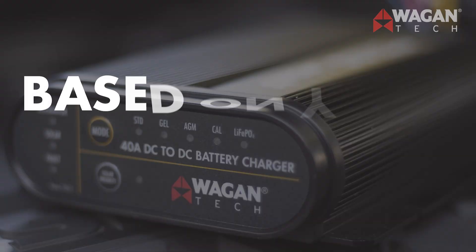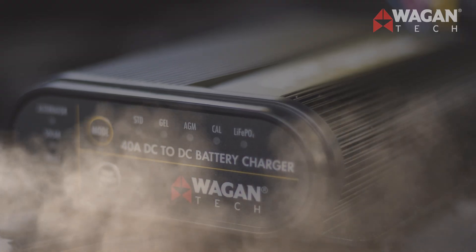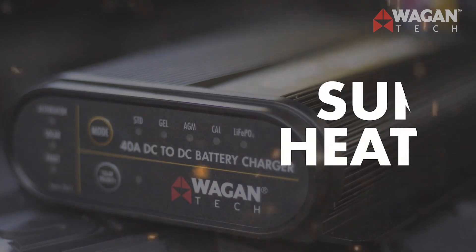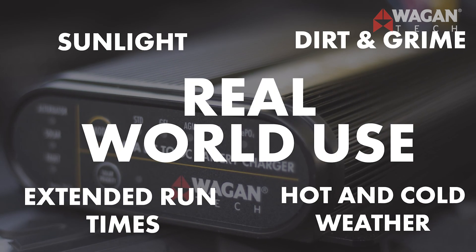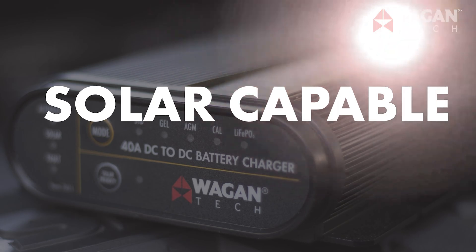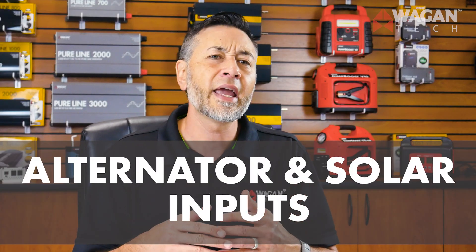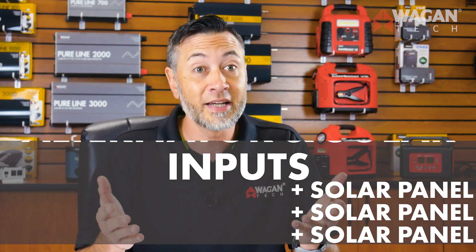Based upon your requests, we found that they need to be rugged. We want our chargers to surpass the heat ranges of our competitors. It also must be waterproof, vibration resistant, and must be able to withstand real-world use. It also must be solar capable. High-end chargers have dual inputs — alternator and solar — and we wanted our chargers to have the ability to add a large amount of solar panels to it. So we did.